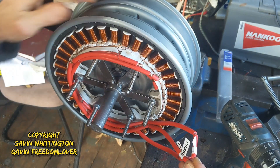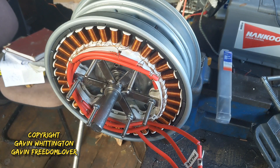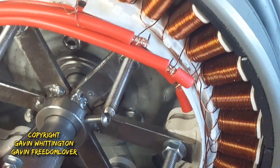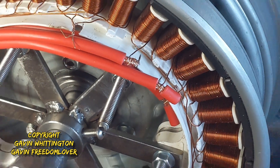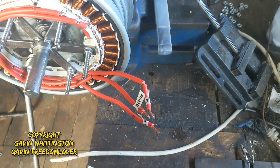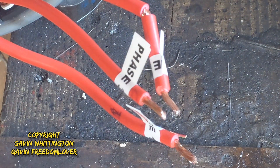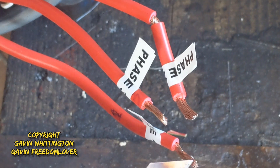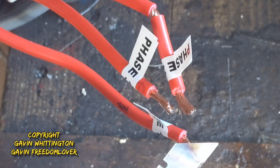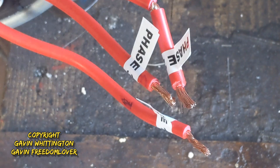Next I'm going to join all three together, and as with an electric bike motor this should become very hard to turn but fairly smooth — and that's what it is: very hard to turn but very smooth. The last bit to do is to solder all the connections and joins together, but I wanted to get it set up and tested first to check it makes some power — and it does. I'm going to turn it and hold this Stanley blade here and try to get it to make some sparks. Turning it by hand — we can see those sparks. Calling it a success.